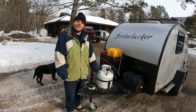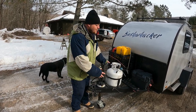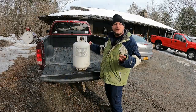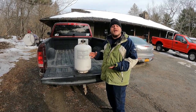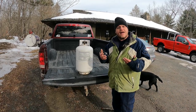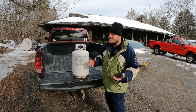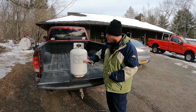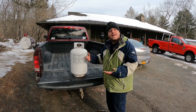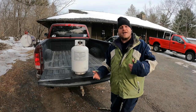The last component to talk about is the propane tank, and this is actually where the magic happens. These tanks hold liquid propane — they're LP tanks — but we don't burn liquid propane, we burn propane gas. The liquid propane boils at a very low temperature, so they fill the tank with liquid and the top section is made up of gas. When we remove that gas to burn, it lowers the pressure in the tank, and the propane boils again to replenish the gas supply. This continues until there's no more liquid to boil off — then your tank pressure goes down and you have to have it refilled.